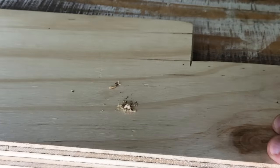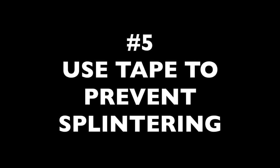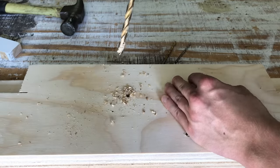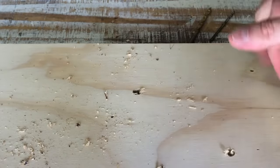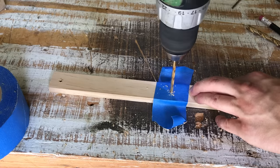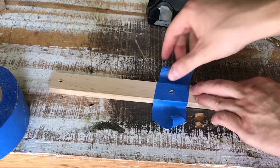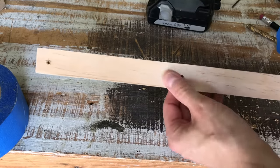The next two tips explain how to avoid tear-out when drilling. Tip number five: use tape to prevent splintering. Just the cutting action of a drill bit spinning can tear up wood grain and cause unsightly scarring — this tends to be even worse in softwoods like pine. If the appearance of your material matters, put a piece of painter's tape over the place where you're planning to drill, then mark your location on the tape and drill through it. The tape adhesive will stabilize the wood grain beneath and prevent the drill bit from doing too much damage as it bores through. When the drilling is done, you can just pull the tape off.